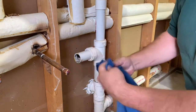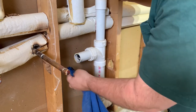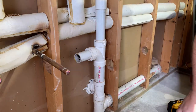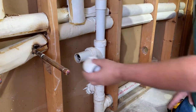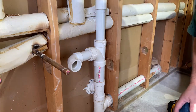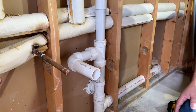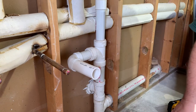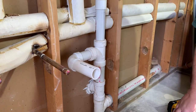Clean out some of the junk that's in the drain. What we're going to do is put a little elbow on there, and then I have a short piece that's going to stick out here. We want the water to run back, so we make sure it's angled up just a little bit. Doesn't have to be a whole lot — the water running down will go into the sewer line.